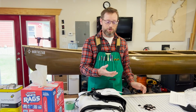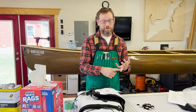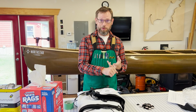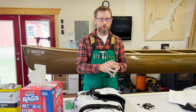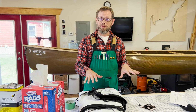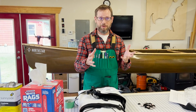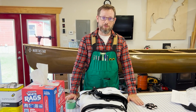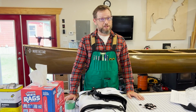It's critical that you get any wax, any silicones, if you used like a silicone-based car wax, mold release if your boat's brand new, 303 protectant. Whatever you might have put on your hull, it has to come off so that you have a clean, uncontaminated surface for the YKK snaps to adhere to. So that's what we'll do next.